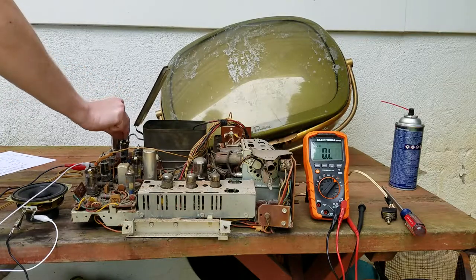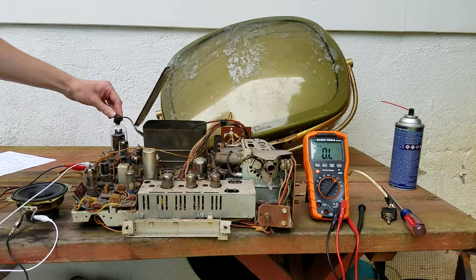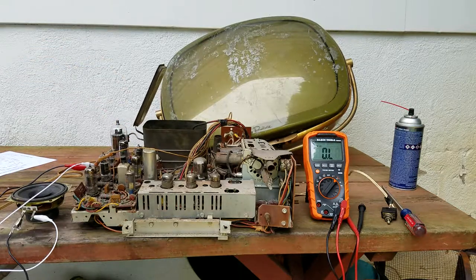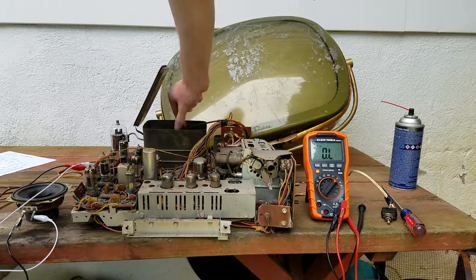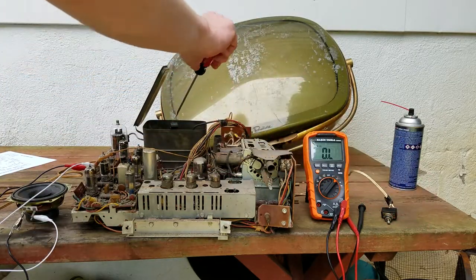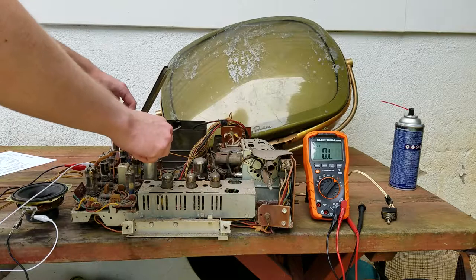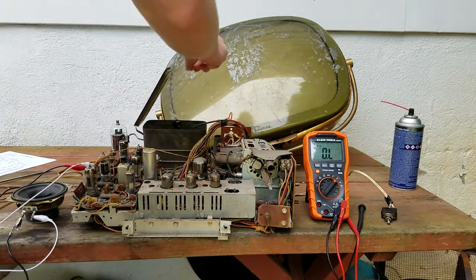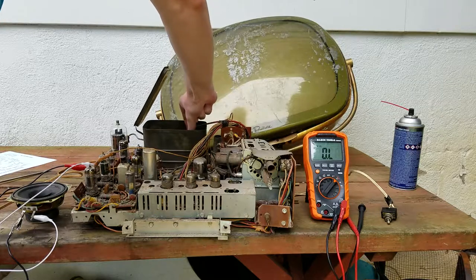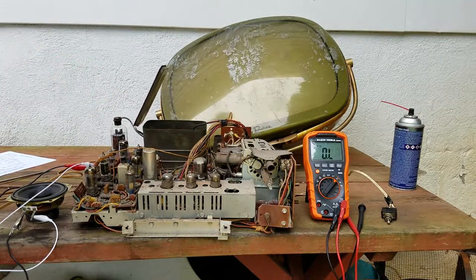This is the horizontal oscillator right here - make sure that's making a good connection. Still see nothing on the screen. Let's see if we're making high voltage - this should not be connected right now. Let's try to arc to that with a screwdriver. Without high voltage... put that cap back on. This is connected - should be getting something on the screen.